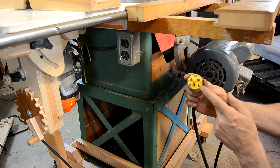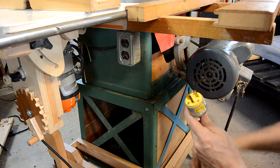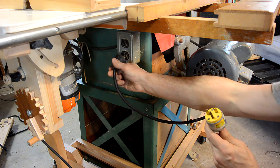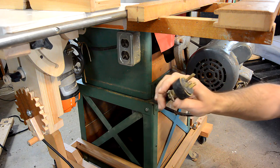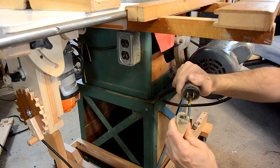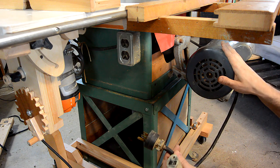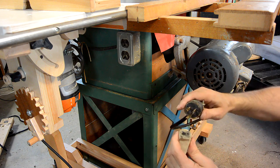I would test this saw right now, but it's rewired to 220 volts and I don't have that kind of plug in here right now. The motor connecting to the switch still uses the old 110-volt plug because these plugs are much more expensive. I can just plug the motor directly into 120 volts, which will derate this one-and-a-half horsepower motor to about a third of a horsepower.